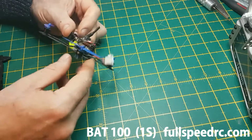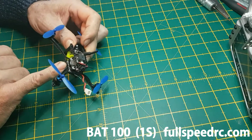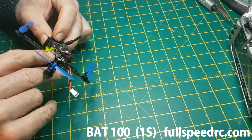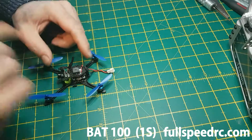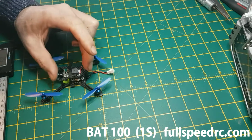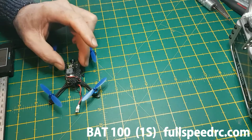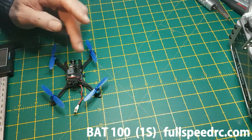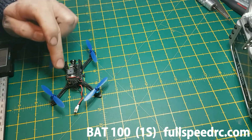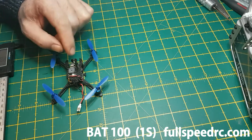The flight controller, what they call a mini cube, consists of a 4-in-1 6-amp ESC and once again an Omni Mini flight controller. The flight controller is an F3 processor with an MPU 6000 gyro again, and these gyros are super stable. So anything with a 6000 gyro in it is inherently going to have fewer vibration and noise issues because of frame vibration. The flight controller comes standard with Betaflight OSD already flashed to the board and configured, so that's pretty good.